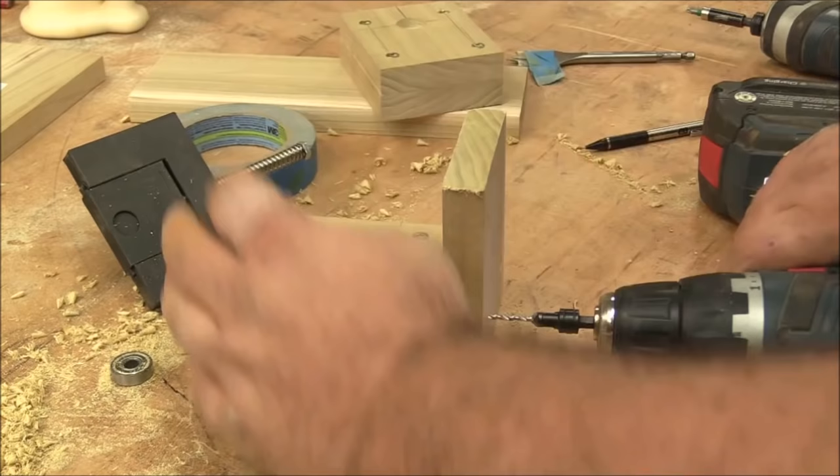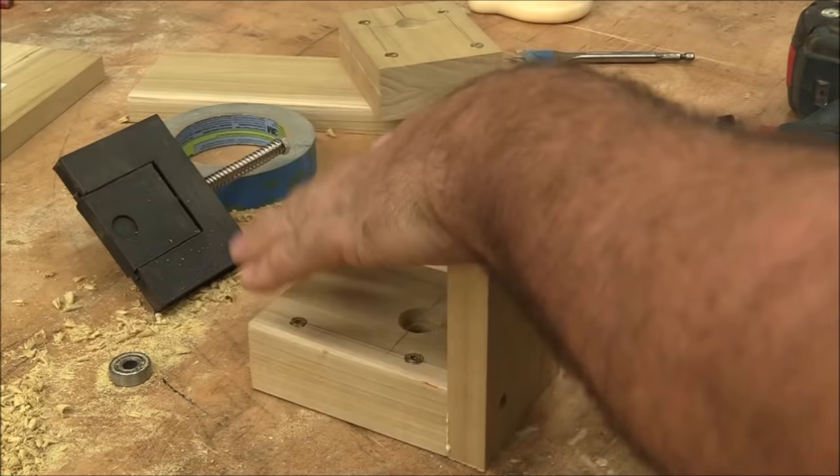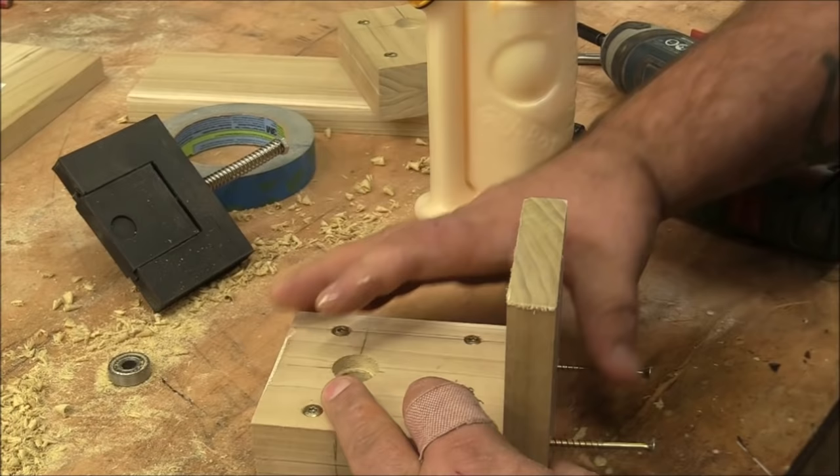Now I just need to add a base plate to each of the towers. I'm pre-drilling these holes and then adding a little bit of glue, and that's going to help those screws line up evenly so I get nice flush sides. Then I'm going to unscrew it, turn the tower around, and screw it back to the right side — I had that screwed to the top.